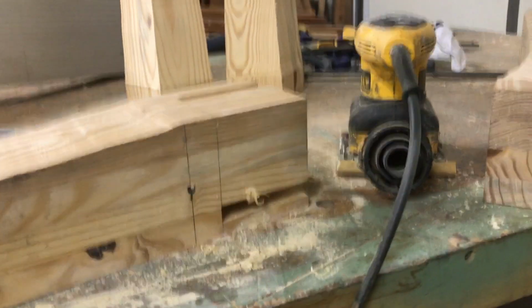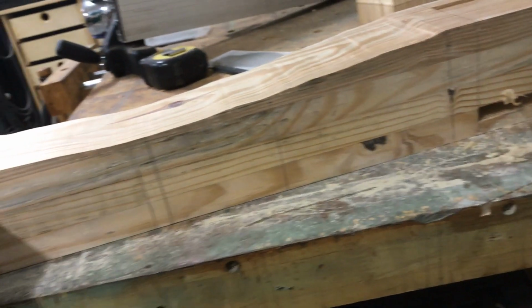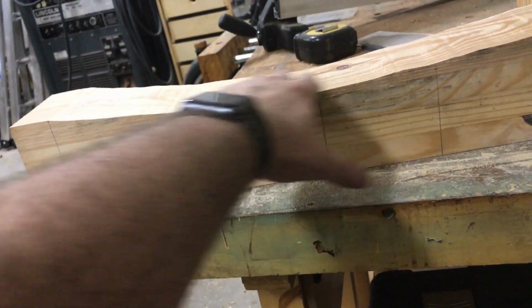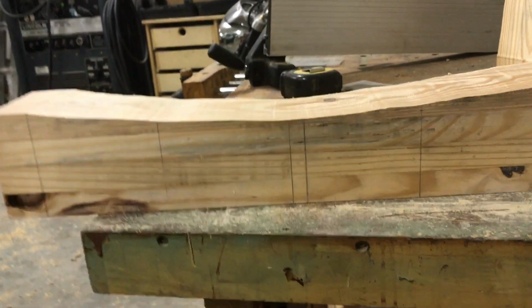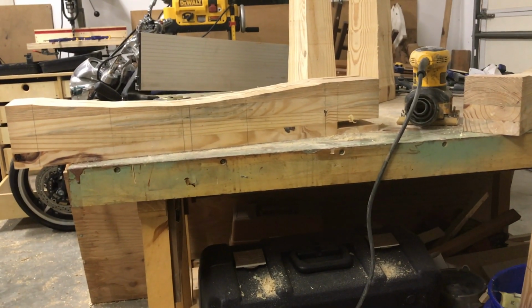I'm sanding with 120 grit right now. And then that should, for the most part, take it all down. And then I'll use 220 or 240, whatever it is, to smooth it out at the end. And so I'll try to get them all as uniform as possible. It's not perfect, but it should look pretty good. By the time I get done with this, like I said, I'm going to use a torch on it. Final dimensions aren't really super critical.